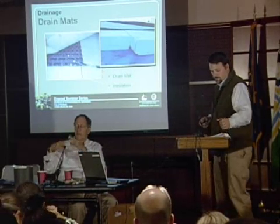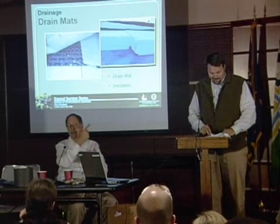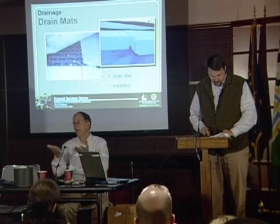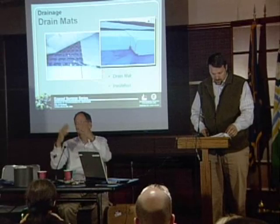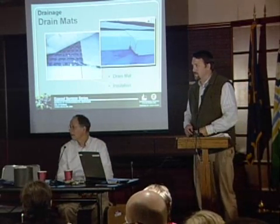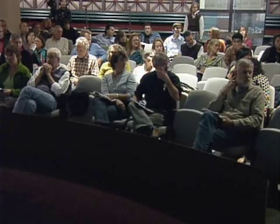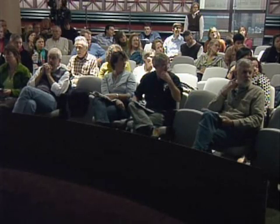And then in the redesign, with the consultants involved and everything else, they thought this opposite approach was better. So the membrane, and it's not an EPDM, it's an asphalt material, goes on the bottom, and thus we have this. One thing about the insulation that I've learned, there's waterproof insulation. One gentleman asked about leaving the old membrane, putting insulation, and then putting another membrane on top. I know that blue stuff doesn't absorb water, where the insulation that goes underneath a typical membrane does absorb water. I think that's a little bit more expensive, so you'd have to value engineer it.